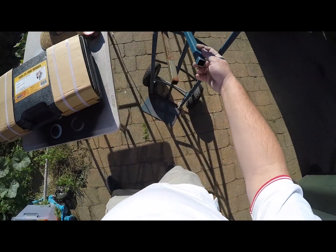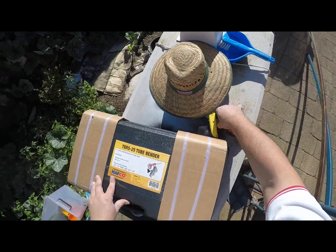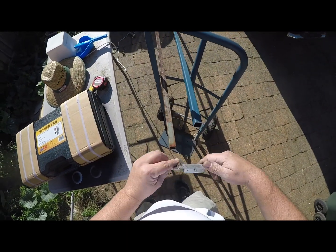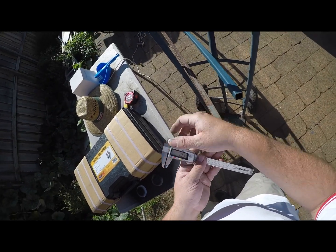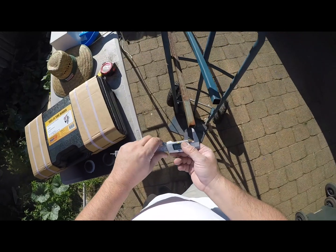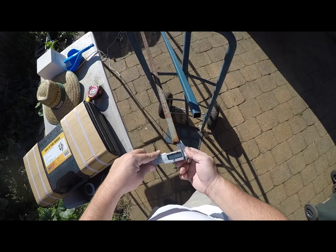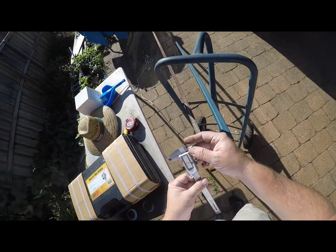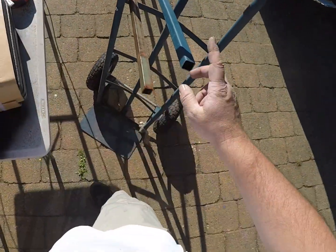Here's our material: 25mm and 20mm. I'm going to put them through the cold bending. What's our wall thickness here? Getting 1.9 — it says wall thickness 1.2. This should be 1.6; we're getting 1.7 a few times. So I think the 25mm is going to be better than the 20mm.